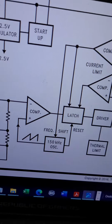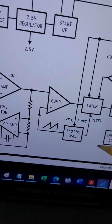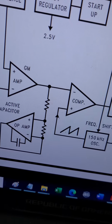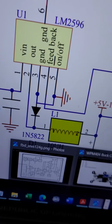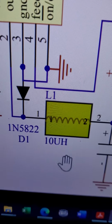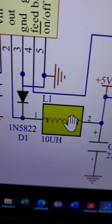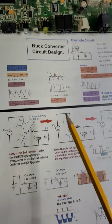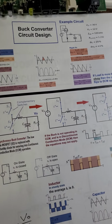It's made by Texas Instruments, and you don't have to reinvent the wheel, because the wheel is already designed for you. All you have to do is read the data sheet, and try to understand how those components work. We have to be careful selecting the inductor, because it does affect the ripple current and the output. So we have to be wise. Of course, all of those mathematical equations are laid out in this paper. As I said, I will give it to you for free, and you will find it either in the description or the first comment of the video.